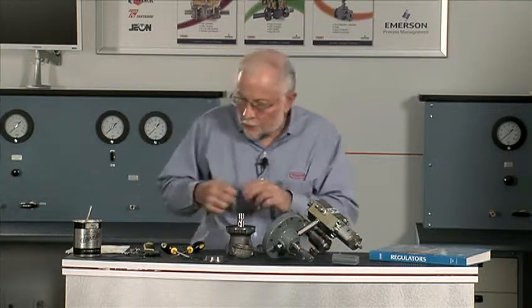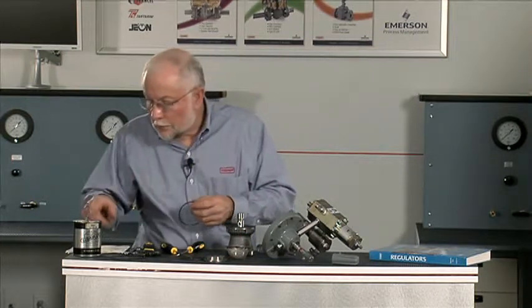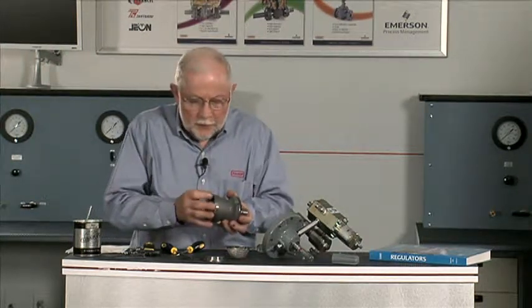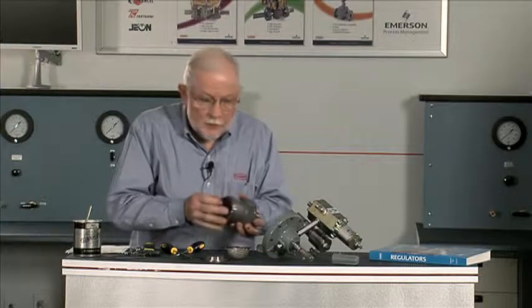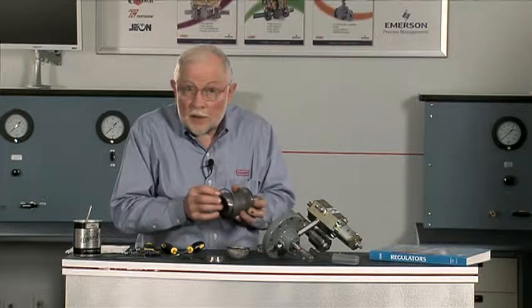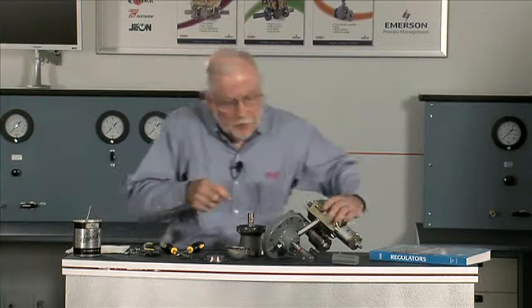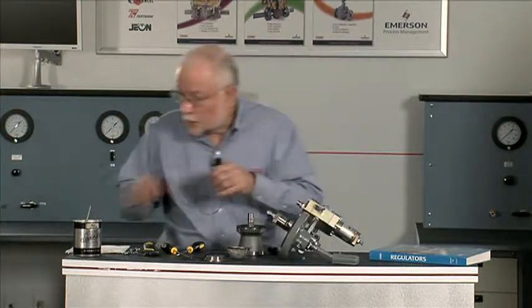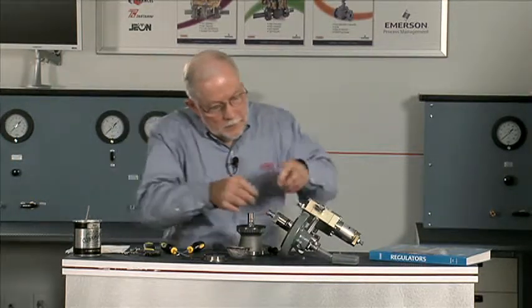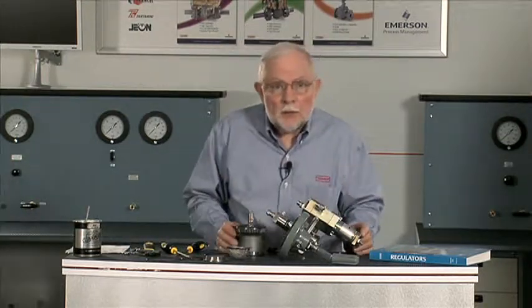When we get over to the body, we've got two O-rings here. First, we're going to put our strainer in and then put this O-ring in — we do want to grease this O-ring. Note that the bevel on this cage is where that O-ring goes; it sets right up on top of the strainer and squeezes out against the side of the body, giving us a good tight shutoff. The other O-ring goes around the bonnet, and there's a bevel around that also. We're going to want to grease that O-ring up as well and drop it down in there.